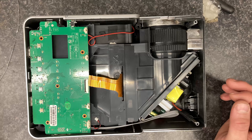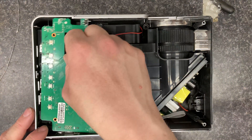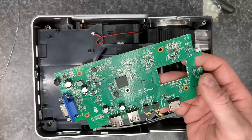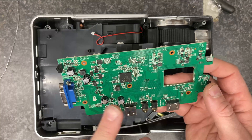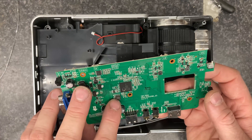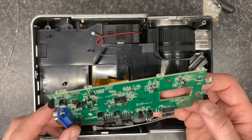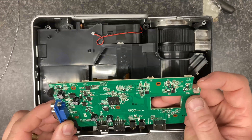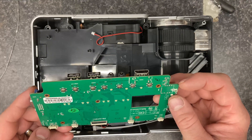Underneath here we have a small circuit board with a single main IC. There's going to be some voltage regulation here. I would say that's an HDMI interface chip, and that's probably a USB interface. So buck and boost power supplies, nothing fancy. This whole board works off 12 volts from what I can see.